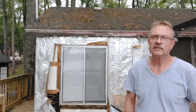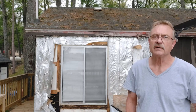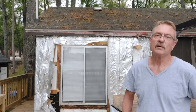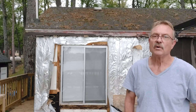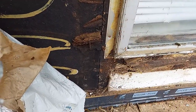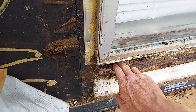I'm going to keep plugging away. I've got a little bit of the siding off — I've got to pull it all off. I wanted to figure out if this was a new construction window or a replacement. I looked inside and I couldn't see any screws going through the sides of the frame holding it in place, so I pulled away some wood and it is a new construction window with a nail flange.